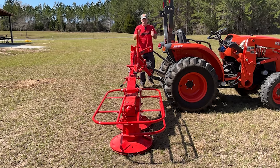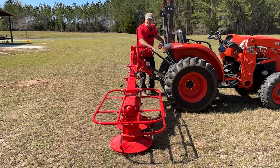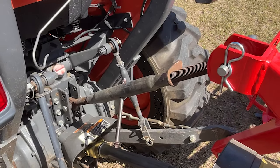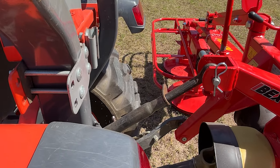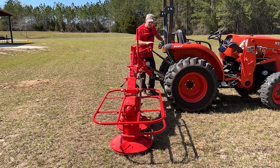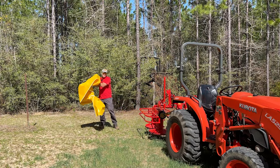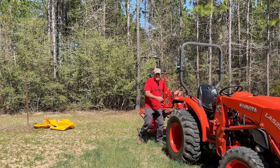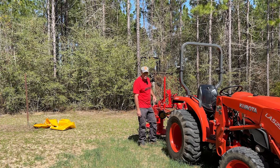To reiterate, you want that mower tilted back so as you're going forward it doesn't dig in — you do that by extending your top link. My top link is fully extended at 29 inches max length and I probably need about 30 inches, so there are only about seven threads holding it in. I can extend it further if I need to, but this is as far as I can extend this top link. It'll be good enough for today's demonstration though — we don't have a lot to cut back here, but it should be enough to do a maiden voyage on this mower after assembly and make sure we've got it all put together right.